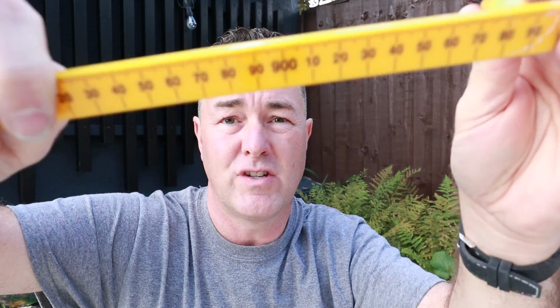These are ideal, and you've seen over the left shoulder where I've been marking off paper, the paper hanging in other videos. I like to use this because if I need to cut down the length of wallpaper with the width, say a width of wallpaper is 22 inches and I need to take 7 inches off it, I can get this ruler, get my finger at the 7-inch position, hold it at 7 inch, put the pencil against it, and then go top to bottom. Oh, where's my pencil? I'm going to sack you in a minute. I put the pencil against the end, hold it there, and as I come down the paste table, my finger's up against the paste table edge, I can draw it top to bottom, 7 inches all the way. Then that gives me a line I can cut to. Self-explanatory really, if you know what you're doing.